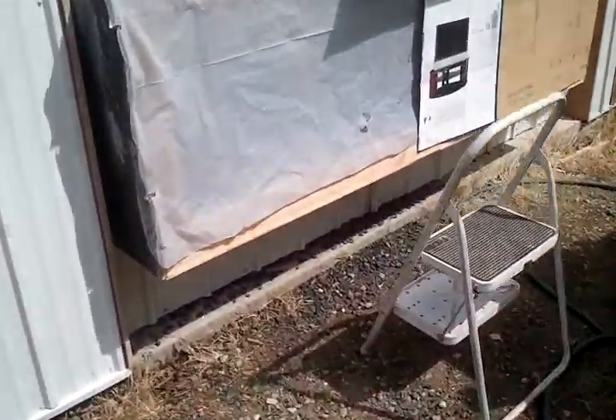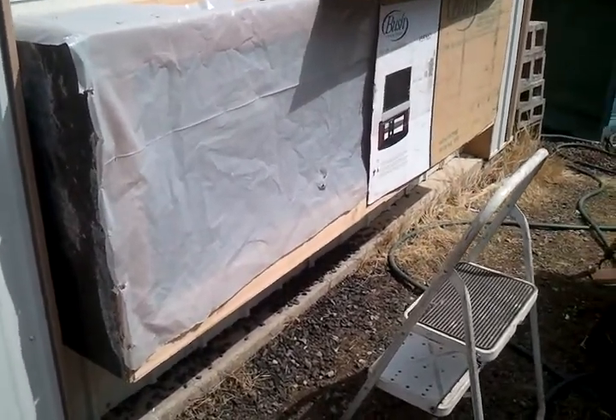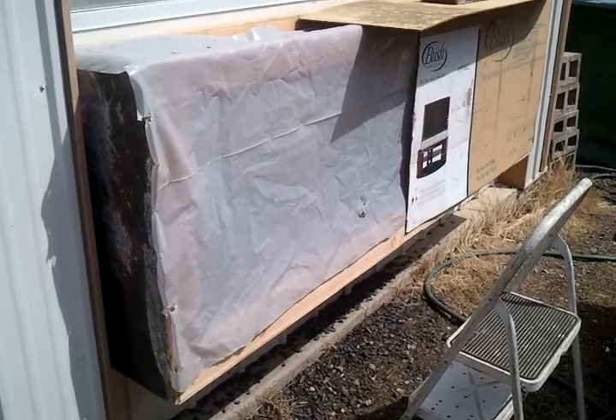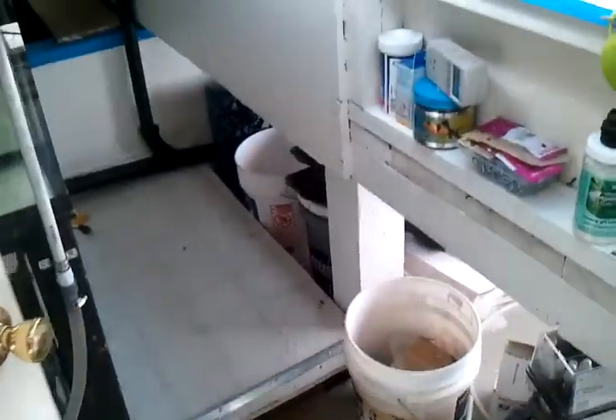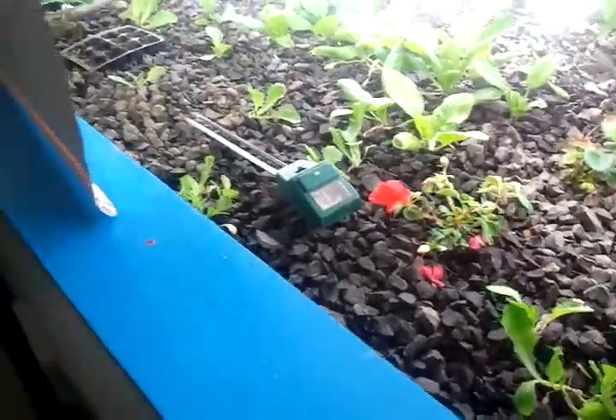What I'm doing here — this is just the beginning. I've got this closed off with some cardboard and some visqueen, but this is going to be filled with evaporative cooler pads that water circulates over, and then the air will be drawn in through that wall into this room. Air will come in underneath of this grow bed here. It'll also come in just in front of the window there, and the air will be drawn across the grow bed. What I've got is a whole house fan up here.